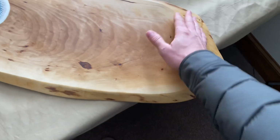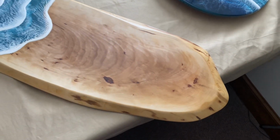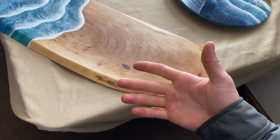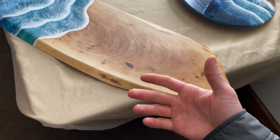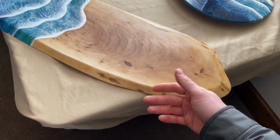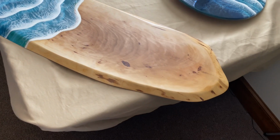It's kind of a natural finish that I use on my cutting boards, not the polyurethane. I would do a bunch of mineral oil, and I'll sand up to 400, then come back with the beeswax and buff that in, and it's just a really nice finish. I don't do that with all of my cutting boards.